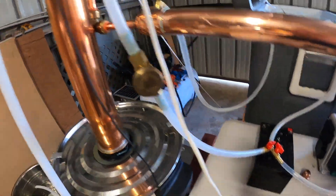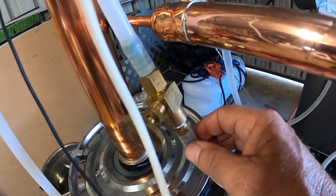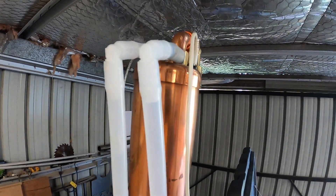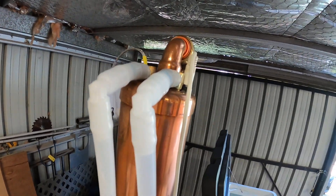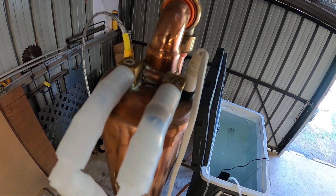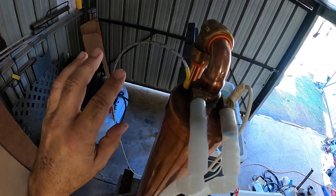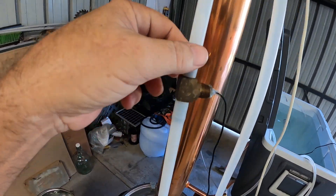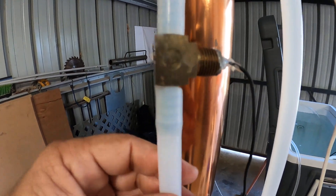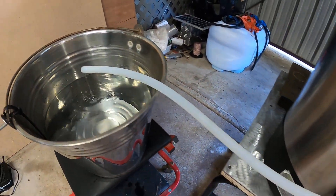From the Y-piece I've got a needle valve to regulate the flow that runs up to the reflux condenser. You can follow the pipe up there — that's the reflux condenser's input. There's a hose there and that's the output hose on that side. That's the manual temperature probe and this one runs to the PID controller. This is the outlet — it's got a brass T-piece in it with the temperature probe — and that's for the hot water that runs out into the bucket.